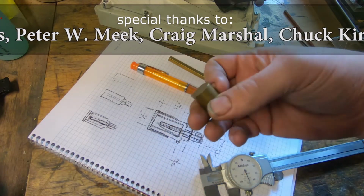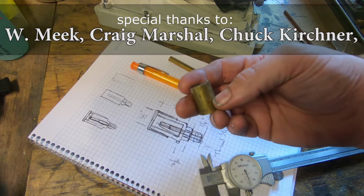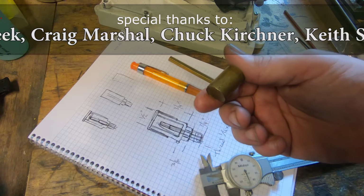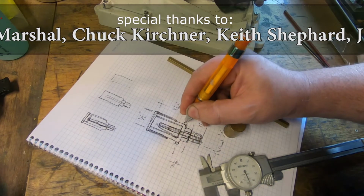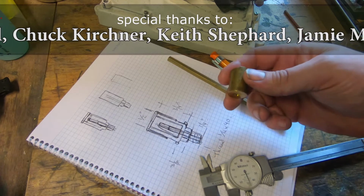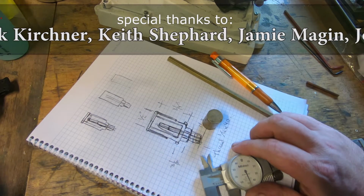I guess probably the best way to do this would be to face one end and then machine one side down and turn it around in the chuck and machine the rest, because we're going to put a bit of a bead on the bottom here, like such, I think. So that sounds like a pretty good plan.